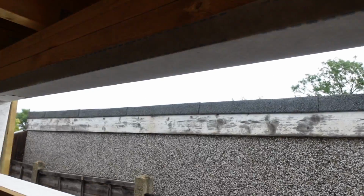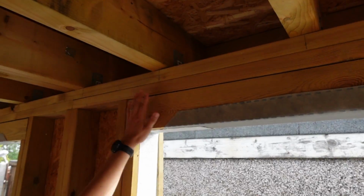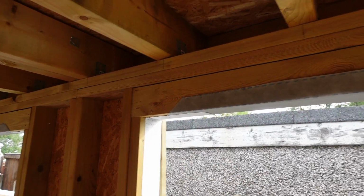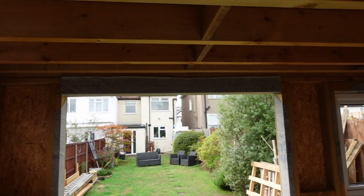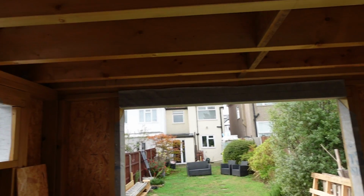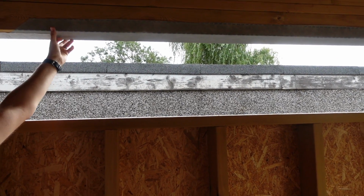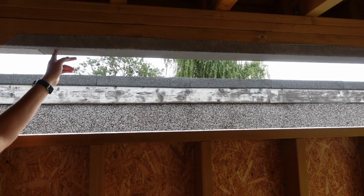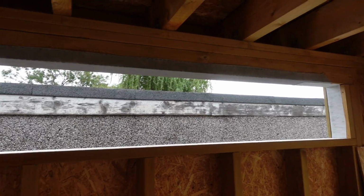That's really good. And what are these? How thick are these ones? Are they cut down? Are those 5x2s? It's a 5x2, and I think I took a little bit off the ones over here. That sits an inch higher. Oh yes, I can see that up there. But that's just a 5x2, and then it's insulated. I've got a 1 inch batten in there, because these are 5 across, and a little bit of insulation just to pack it out. Okay, so it's all nice and square.